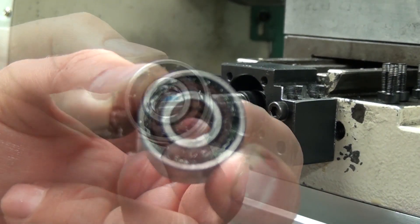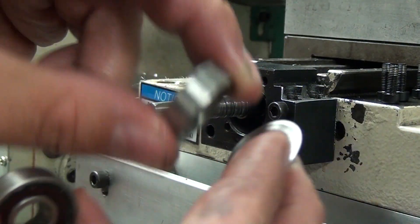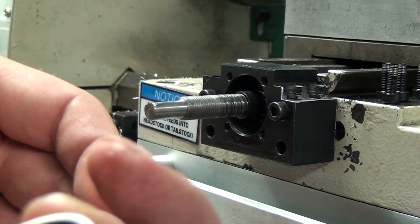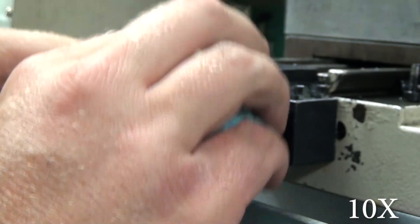You'll notice there's no grease in there, just a really light oil. What I did was pack them with some marine grease from the local auto parts store - I've been using that quite a bit. Then again the shim goes in between the two bearings. That actually worked really well.